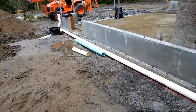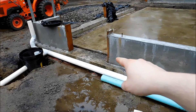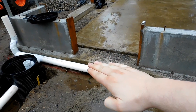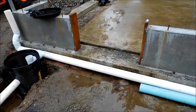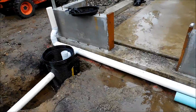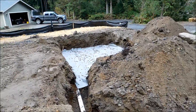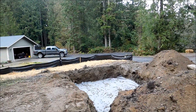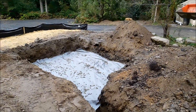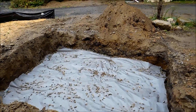The reason I had to put the piping next to the footer is because my man door and my concrete slab will come out over this footer and out over the top of this to be level with the existing concrete slab. And that is what an infiltration pit, or eye pit, or catch basin, or drain basin looks like — I've heard it called a lot of different things. In Kitsap County they're referred to as an eye pit.